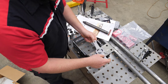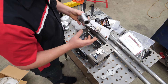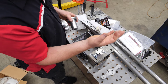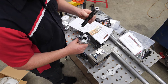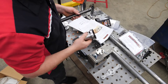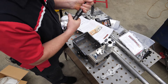This is our T-handle, and that goes right on there — we can take that off and adjust it as needed. So let's talk about why this is a bit of an investment. My old tubing notcher uses bronze bushings, basically for the shaft that you hook the drill to. You'll notice this one has true roller bearings in there. With the old unit, you always had to spray it down so the bronze bushings don't burn up. This is quite the improvement.